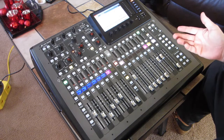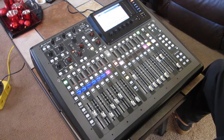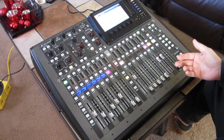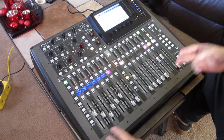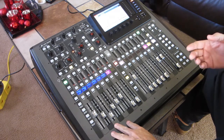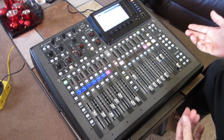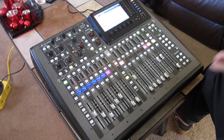When the videographer is happy with it after one or two test songs or sound checks, we can pretty much shoot for that in between. I give him one mono feed — he's got two inputs most of the time — so I'll give him one off the board as a mono mix, and then he can use a shotgun mic or another mic to give him a little more variation, varying between the shotgun mic and the front-of-house soundboard mix.